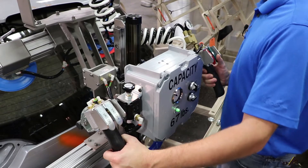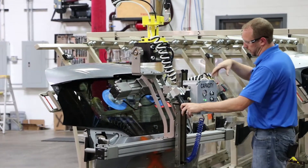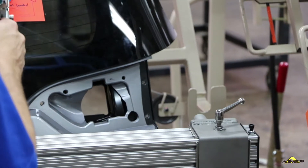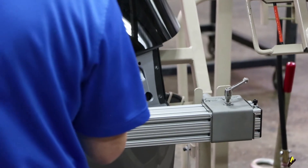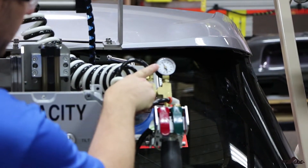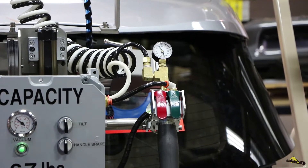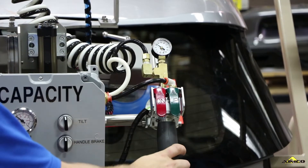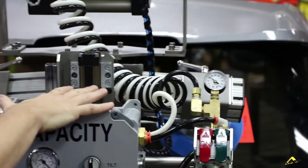This can help the operator locate it into the leak test fixture and into the rack fixture. There is a rotary actuator here that will provide a slight tilt if needed in between the two positions between the leak test and the rack. To set the part in place in the rack, the pin will need to be guided into the feature on the rack. With the part weight, you'll notice on this pressure gauge here, we're above 40 psi. When you set the part into the rack, you want to be right around 30 to 31 psi so that the tool will be floating in that position. Set the part down, pay attention to the gauge, get enough pressure off of it to where we're at 31 psi. Now the common trigger and vacuum off will release the part. That way the tool stays nice and level.